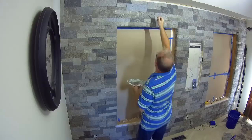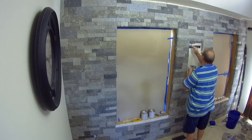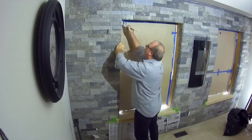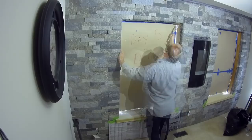It's just a matter of splotching the paint in — you're not trying to actually paint — then I use a sponge to smooth it over, which feathers the surfaces in and blends it into the stone. Now I'm painting these windows with a semi-gloss white. Down there I put new window sills in along with front molding that overhangs the stone, and I used latex caulk to make sure everything blended in nice and neat.